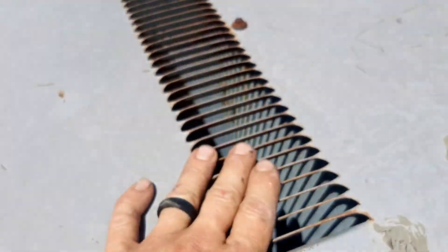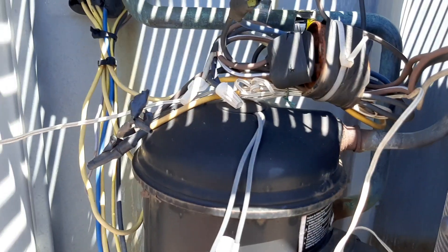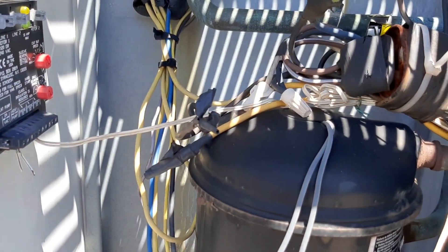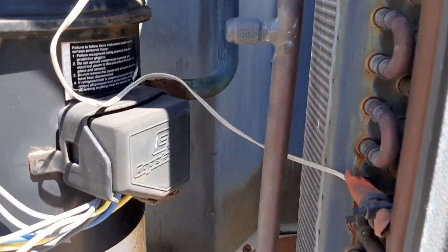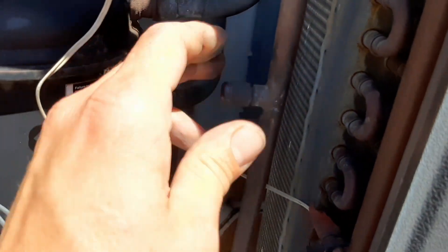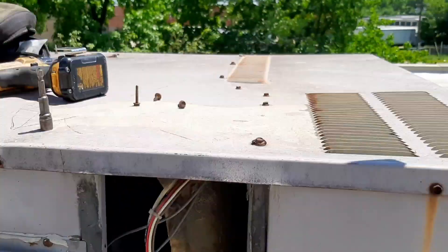These discharge this way and out the top, and it's beat up inside. There's crap you can't see up top but it's got buildup up there. Told them about that - they're apparently gonna replace this unit. The run cap's been in here too. Looks like they had a low ambient speed control that someone did something with. I'm not gonna do anything too crazy to try to make it perfect since it's getting replaced at some point. I don't see anything that really looks like a leak, but I'll bet it's in that evaporator. Let's get some gauges hooked up, cycle it, and see what it looks like - we're probably gonna have to add a little refrigerant. Blower was going the correct direction. Filter's a little dirty but nothing that would have caused it to freeze up.